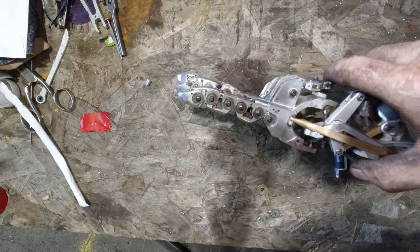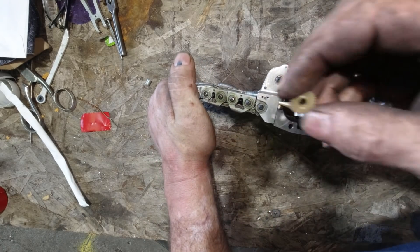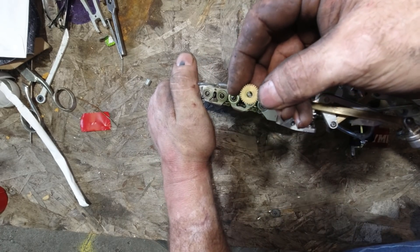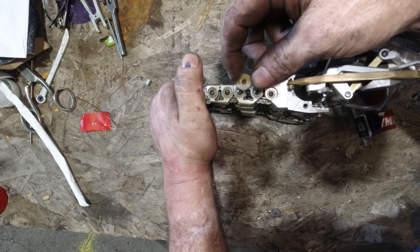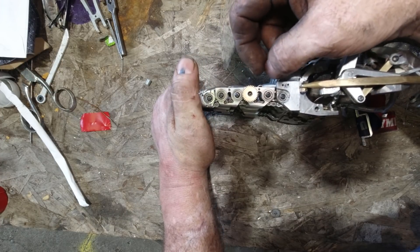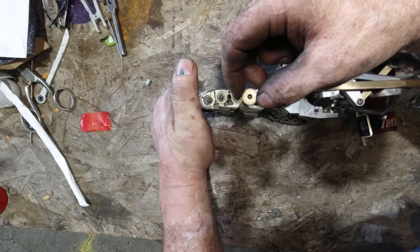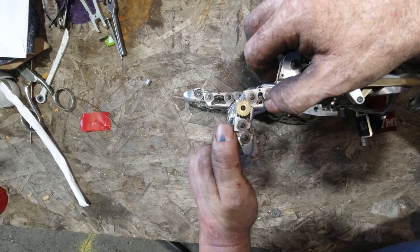Last week when I was on vacation at UAMS doing cancer testing, I noticed that the motion of the fingers wasn't equal as they closed. The difference was related to the tension of the springs that I used to return the fingers to extended position. The difference was most noticeable at the MCP joint of the pinky — the joint would become out of time if I quickly and repeatedly closed my hand.